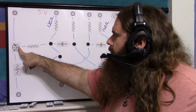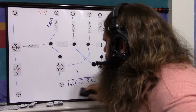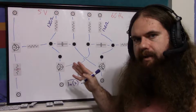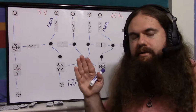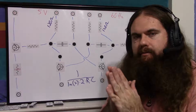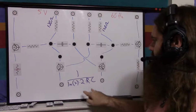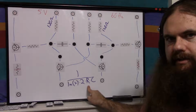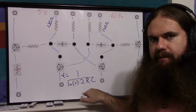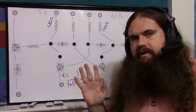This is connected high. When this is high up here, then high to high, this is not forward bias, transistor's off and so forth. But when there is a large disparity, not a ridiculous one, but a large one, between the capacitor and the resistor, when the capacitor is smaller and the resistor is larger than the normal numbers you'll see on the internet. In fact, the more that disparity, bring down the capacitance, bring up the resistance, and you get the same value, because you can see if you raise resistor and lower capacitor correctly, you can get the same result, frequency equals. But the more you do that, the more of a disparity you make, despite getting the same frequency value, the sharper it is. So you can get a nice square wave out of it.